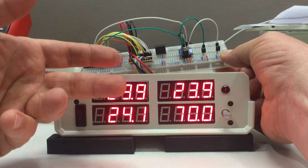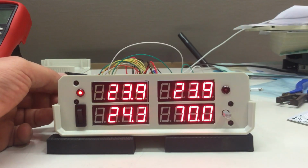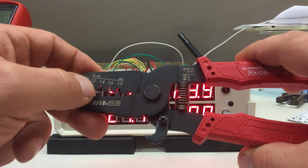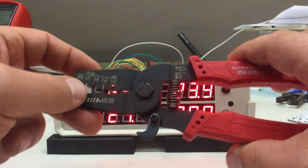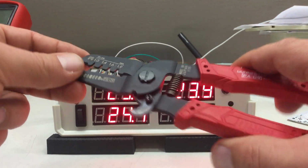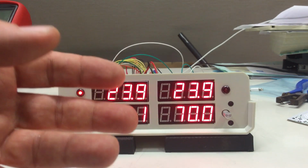And that was not the first time I had a problem with crimp connections. I noticed I used the wrong crimp size for it. 1.4 instead of 1.6 for the wire itself, and 1.6 instead of 1.9 for the strain relief, but it looked. I had to bend it a little bit back and forth, but it looked good. But obviously, it didn't work. Yeah, not the first time I messed up a crimp connection.